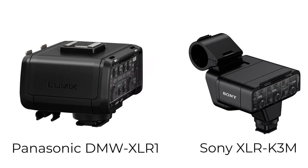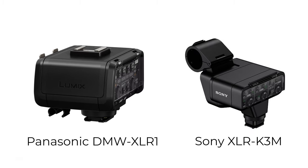Hi, I'm Marcus Hutzel, and in this video we're talking about how you can, and if you should, use a standard XLR style microphone — either a dynamic microphone or even some condenser microphones — with your mirrorless camera using only the eighth inch TRS mic input on your camera, and without having to buy one of the expensive XLR modules for specific cameras like the Panasonic DMW XLR1 or the Sony K3M.